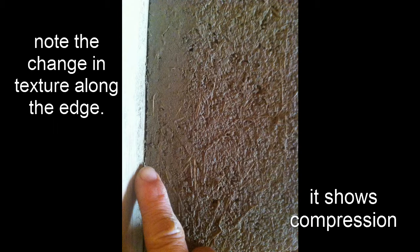This shape coat gets rather thick in places, and the edges are no exception. These edges butt up against the grounds and the post, and sometimes against adjacent clay walls. Each day after plastering and the following day or two, time would be spent going around to all of the edges to compress them. The compression must be done with attention and care the first time, or you may cause a nasty ridge to form between the compressed bevel and the intended wall surface.